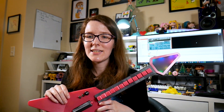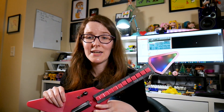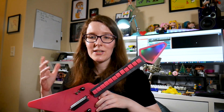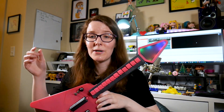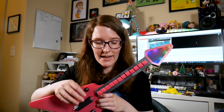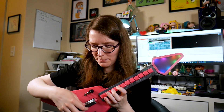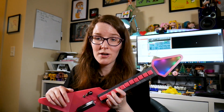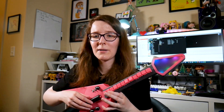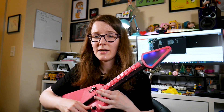The code is in CircuitPython. It's kind of standard stuff — I'm using the CircuitPython MIDI library. If you've done any DIY MIDI stuff, it's fairly self-explanatory. I press the note, it sends note on. I release the note, it sends note off. There is a moment where if the switch is engaged, I hold down the note and nothing happens. But if I press down on the strum and that note's engaged, then it sends the note on, and when I release, it turns it off. And then I'm constantly checking what the state of these knobs are, and that's just constantly sending.